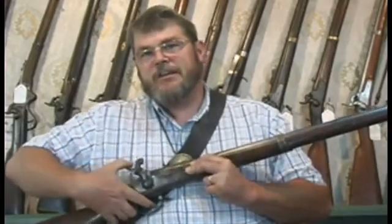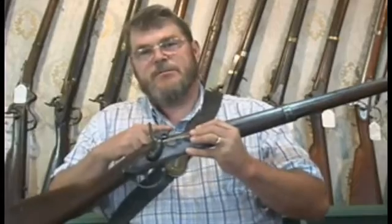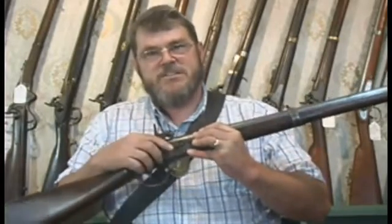Typically you temper a spring, that is you just soften it enough so that when you pull the trigger it does what it needs to do. It advances the hammer, and it either pops the cap or it strikes the flint. If the spring is not tempered and if it is too hard, it will crack. Or worse, if it is overheated, it's too soft or mushy and it won't fire at all.